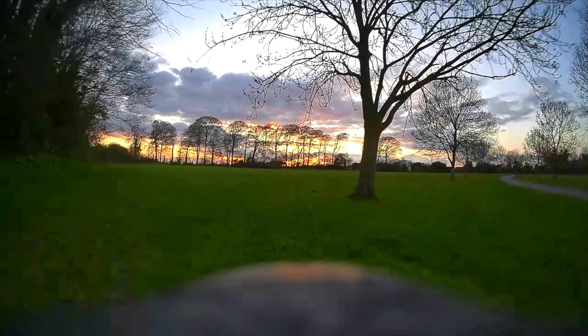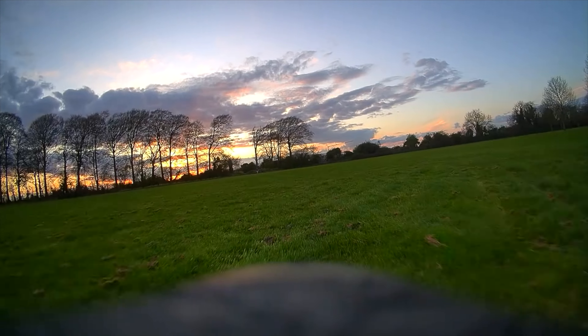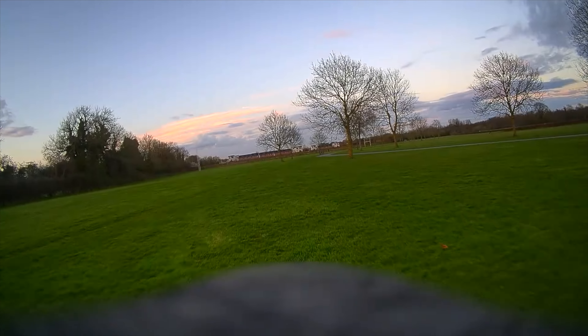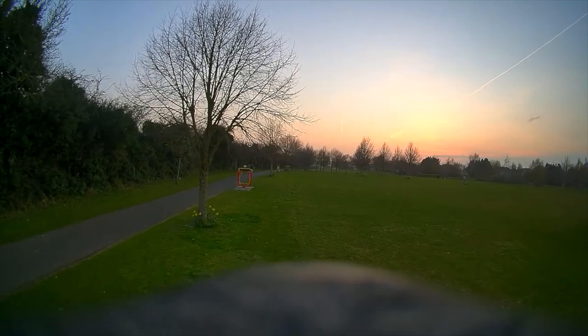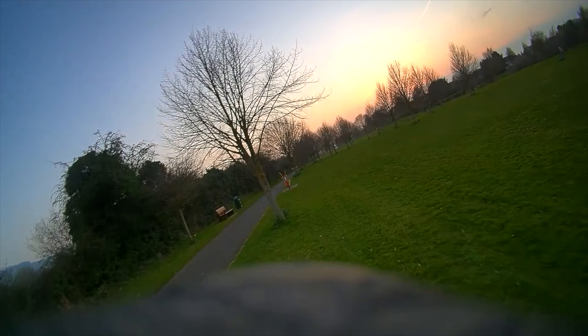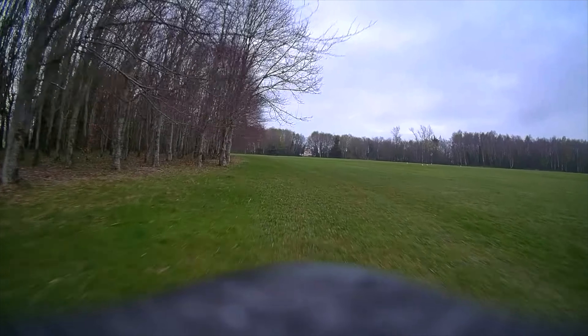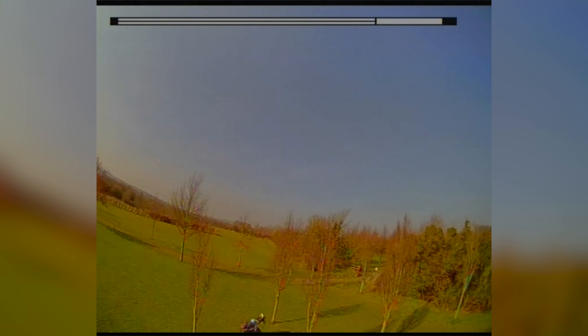The all-up weight after the digital conversion went from 229 grams up to exactly 250 grams. Here is a short DVR clip to show you the results, recorded on my DJI goggles. I'm still new to DJI — I've noticed with this Polar camera you can't set it to prioritize image quality like I can on my other setup with the standard DJI camera. It's set to prioritize latency instead, which is probably quite a good thing for this plane since I'm flying low around objects. I also got this camera for its low-light capabilities and the ability to fly in evenings.